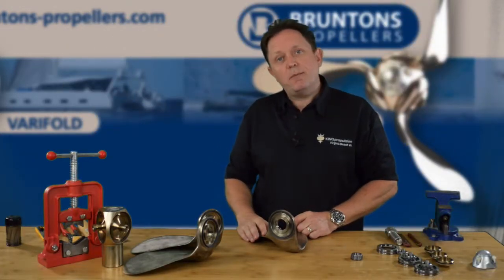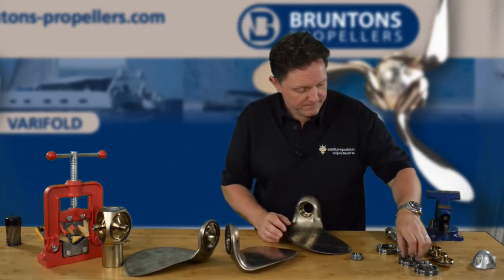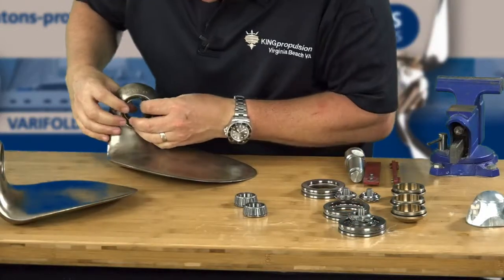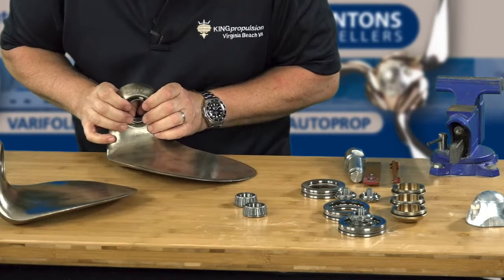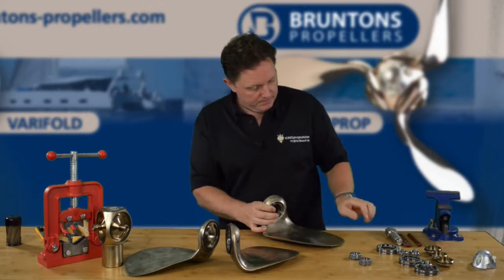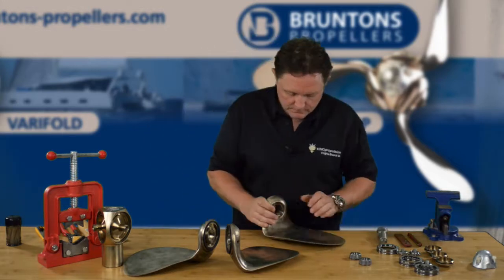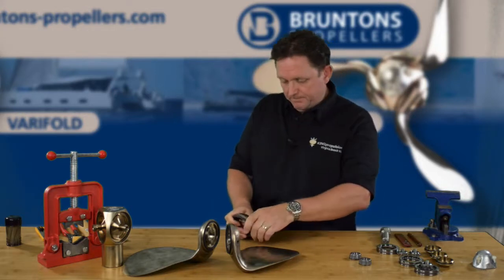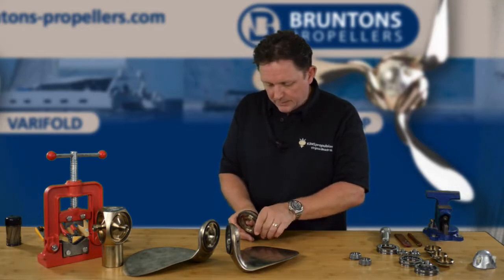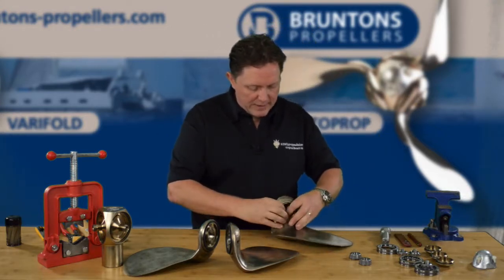With the blade being an L-shaped blade we haven't done any damage to the lip seals. Continuing with the other ones — they're just little cone shapes again. You need to keep it as parallel as possible, use as little force as possible, and sometimes as I'm doing here it's kind of walking in. Just gently walk it down. There we go, it releases itself. It can be a little troublesome sometimes but it just pops in — it's a very tight fit, and the more parallel you keep it the better.